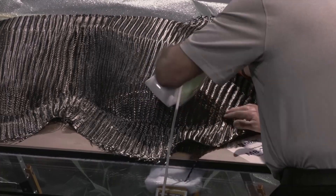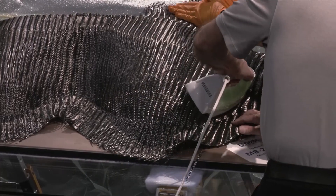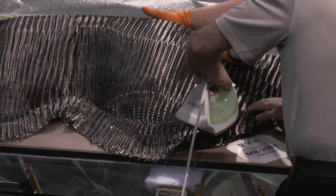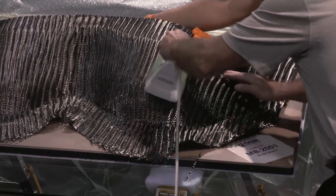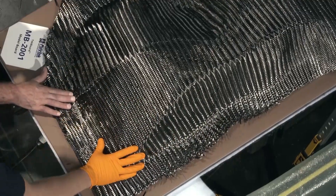With low-cost tooling we could actually build these preforms off-site. That frees up our production tool, and we could be infusing a part while we're still making preforms, or we can do it off-site altogether — nest the preforms and transport them to the production site.